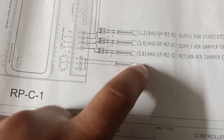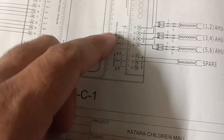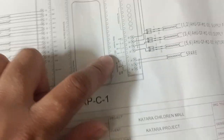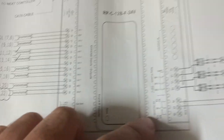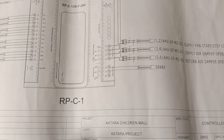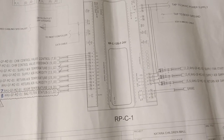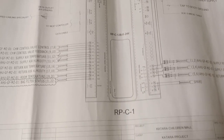On the other side we also have some terminals. These are for start/stop commands — all for control. It is written relay output. We use relays for switching on and off any devices. This side is for relay outputs, meaning through these we can give commands to the devices, switch them on or switch them off. It is very simple for BMS. In the next video I will show you how to do operation in BMS software. Thank you so much for watching.